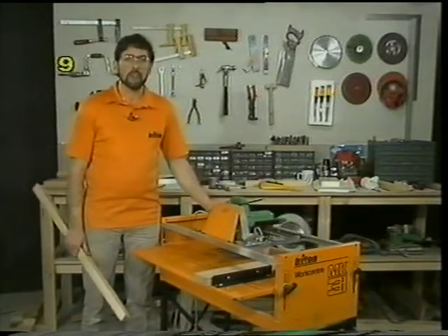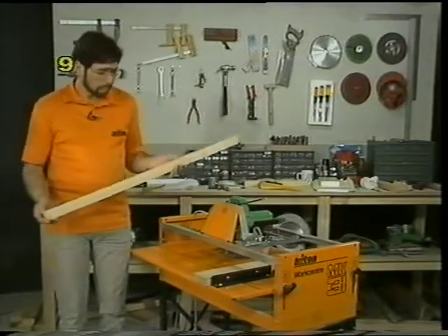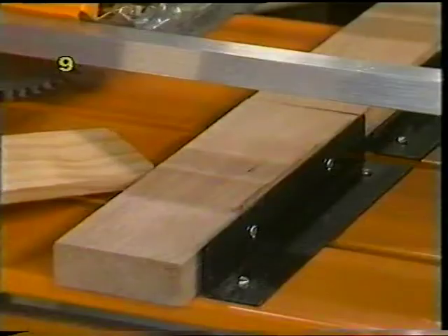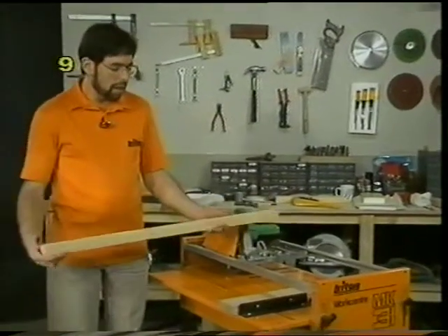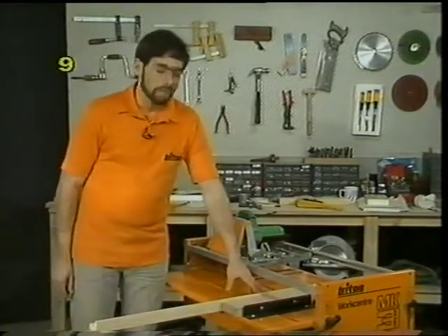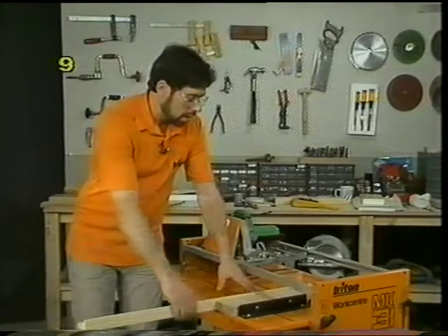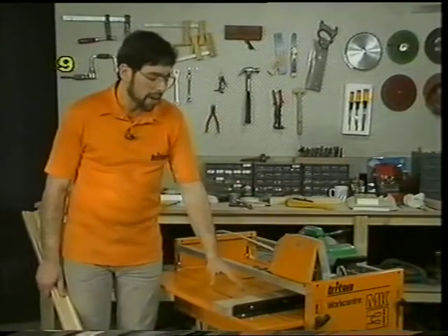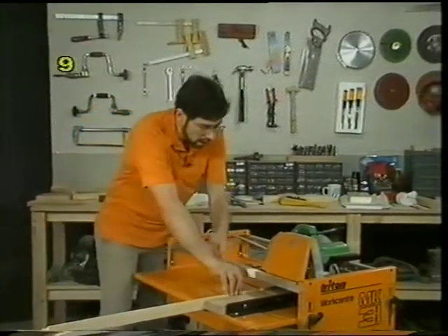However, there are some instances where you may want to use a climb cut. For example, a long piece of moulding, cornice or architrave — you want your good face to be down to minimise splintering. Now obviously you can't rest this safely and securely on its good face down, so with a piece like this you want to cut it with a good face up so it can rest securely on its flat back with the square side against your work stops. You want to do it as a climb cut so that you're not splintering this top face. Pack out your work stops so that you can start off with your saw blade completely parked behind the work stops, then you can slide your piece of wood in on its flat square base and cut with the back of the blade.